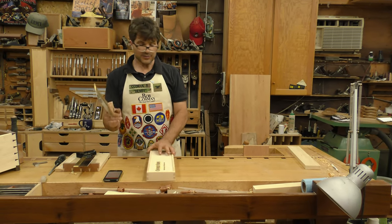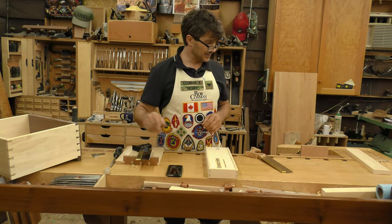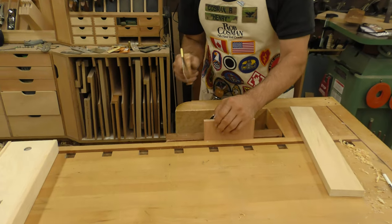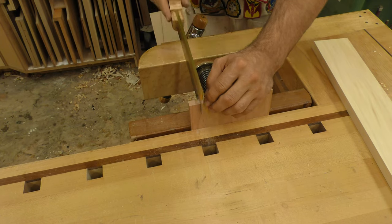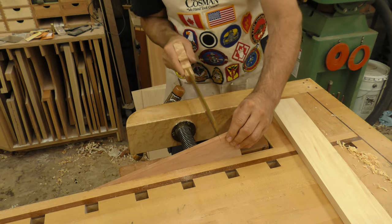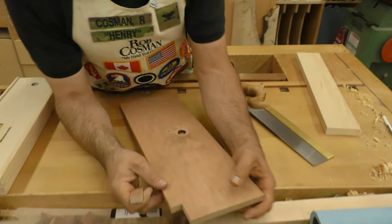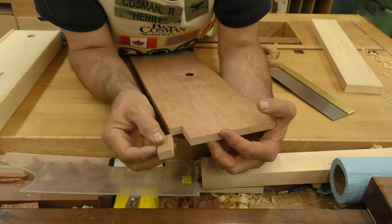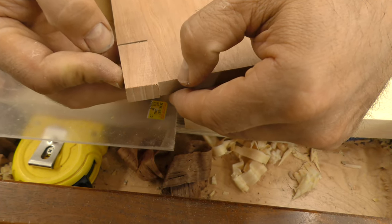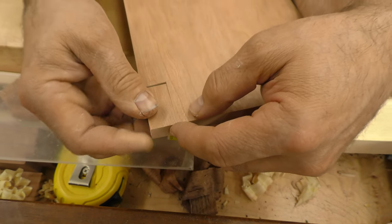Alan Peters taught me something about this. Here's my dovetail saw. You should be able to take your saw, your joint, and put it together right from the saw. So you want to do a dovetail like this — your best bet is always going to come right from the saw. Now here's what I do to test it. I've got a piece of half-inch cherry in here. Take my dovetail saw, come in about three quarters of an inch, and make a cut down about as deep as the saw will go. Turn the board on its side, and I'm going to cut that piece off. The surfaces left from your saw have to be up to snuff — meaning they have to be flat, they have to be smooth. If they're not, when you put it together, it's going to show gaps. There's the surface on one side, there's the surface on the other. When I put the two pieces back together, it almost becomes invisible. Turn it around so we're not matching grooves, and you get the same thing on this side. So when you cut the side of your tail and cut the side of your pin, and put them together, you get a very good joint that makes contact all the way, and you get an excellent glue surface.